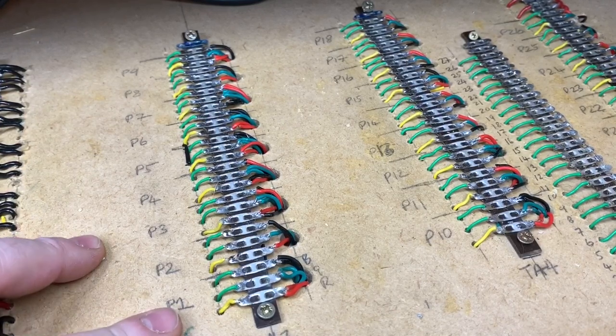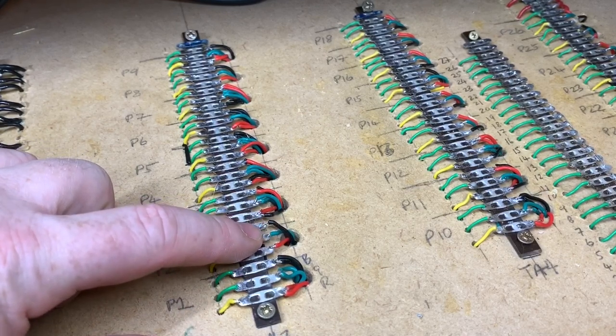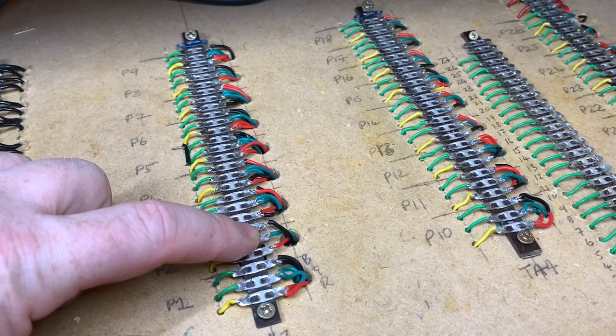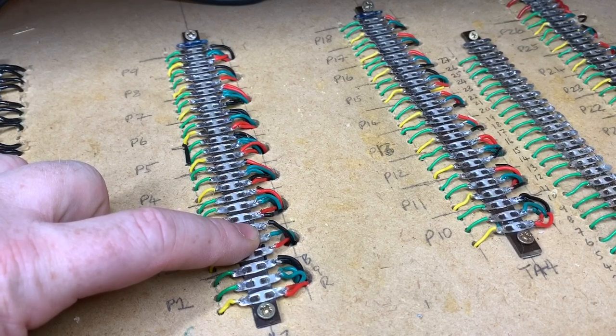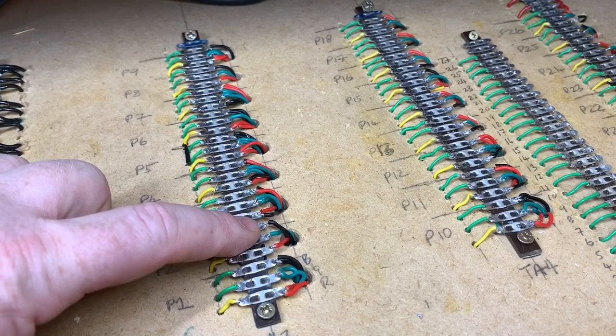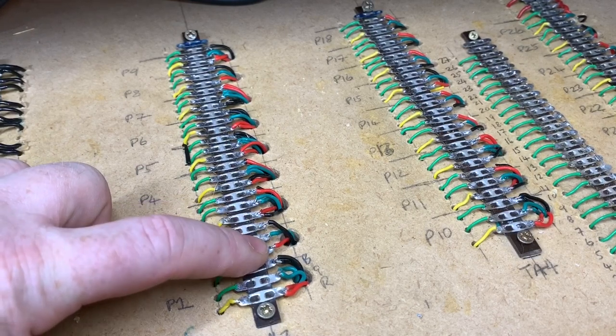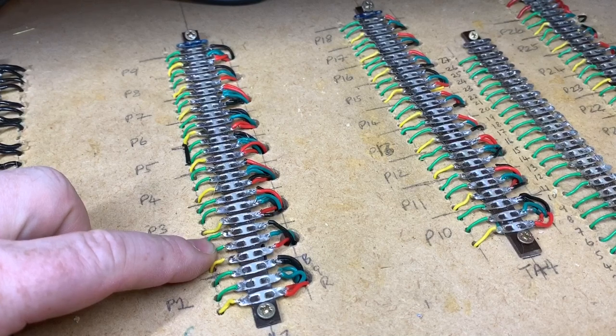So what we've got here is from the actual point itself, we've got the three colored, the gauge master wire, which comes with a red, green and black combined, the three wires for the points. Found that so much useful to actually be wiring points. So that's coming in. So black is either left or right, red the opposite, and green is the common. And then coming over here, we've actually got the wires here that go off to the actual control panel, etc.